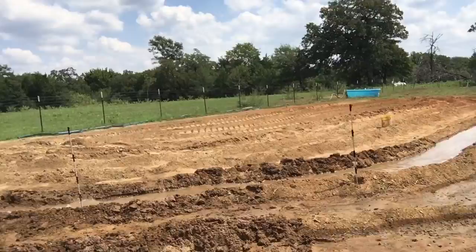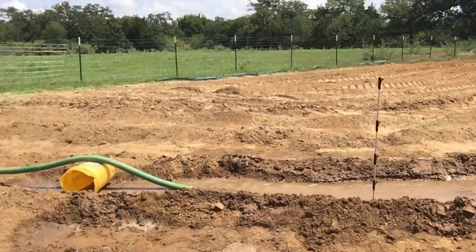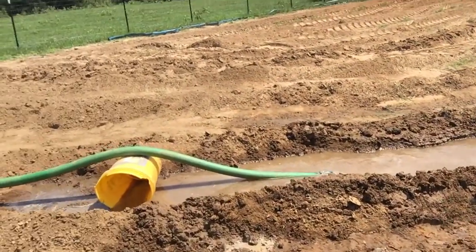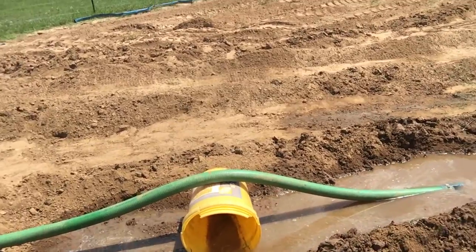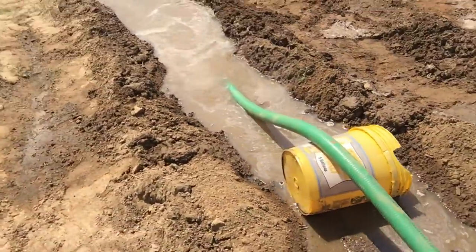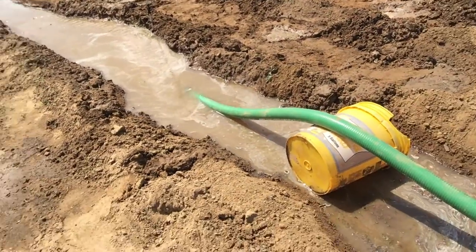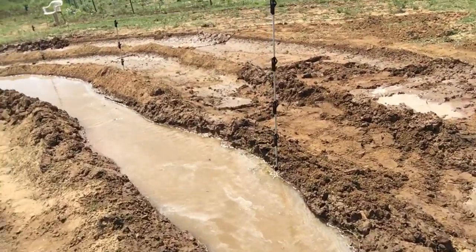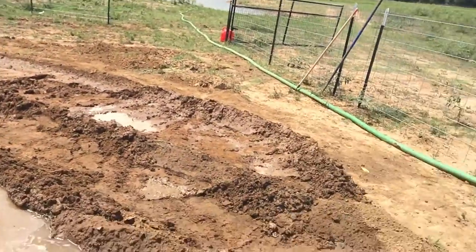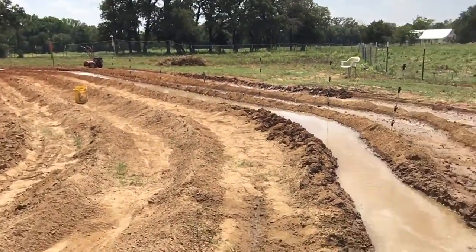Where all those little pools are — as you can see, the bottom ones had a little trouble. You've got to fine-tune them. But the water is coming in and this whole thing is on contour now. For the other lines, you're not going to run a transit line on every single row — you just have to get a feel for the way the land is moving.